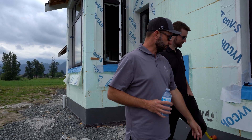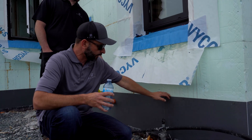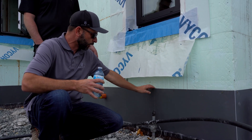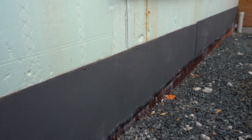One of the common questions with ICF is what do you do with ICF at grade? One of the things we do is we use a plastic product called Tuff-X. It's a high-density HDPE. It comes in a variety of colors, and we use it in a charcoal gray just because it's the most traditional color for a foundation.